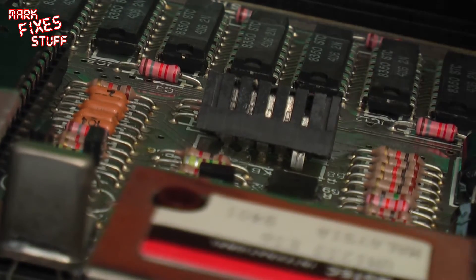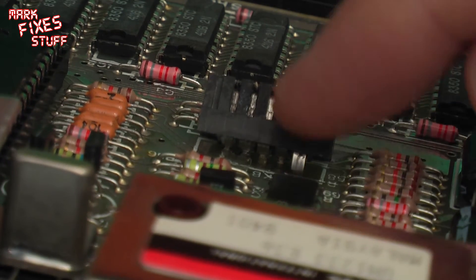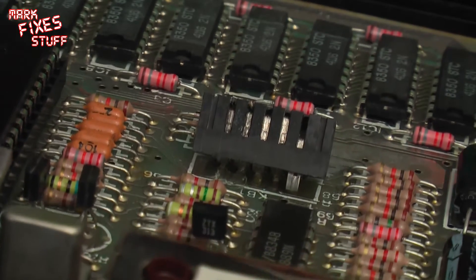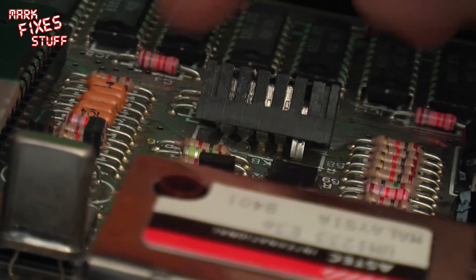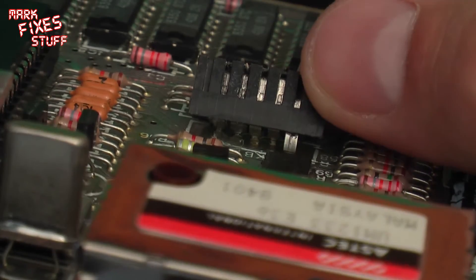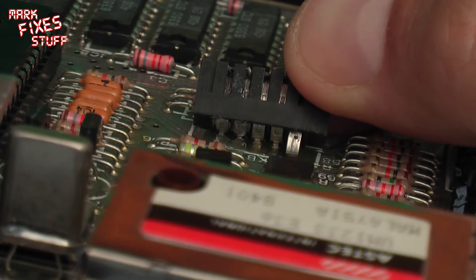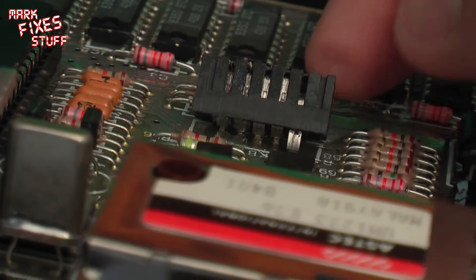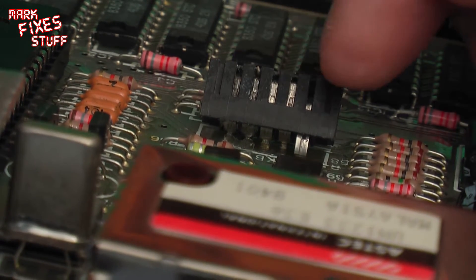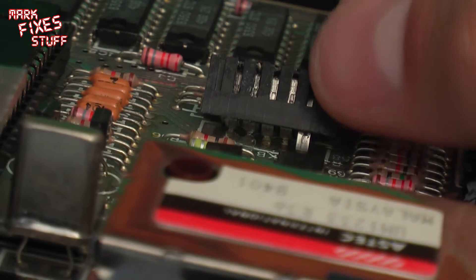What I've found was there's a large lump of glue underneath the socket just there — you can see it. So that's not going to allow us to get that pin out because it's basically set solid in there. Can you see the actual leads of the socket going into the board there? One came through here. This is the best way to do it if it hasn't been glued — just pop those through, lift it off, and then you can desolder them at your leisure.